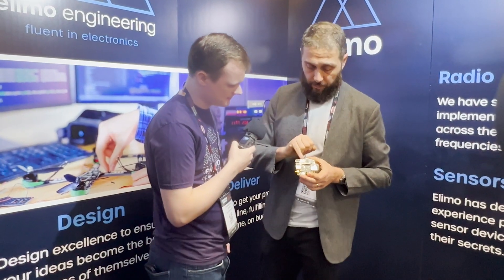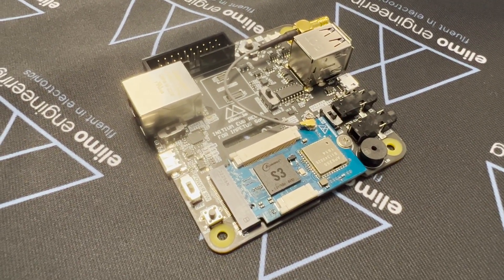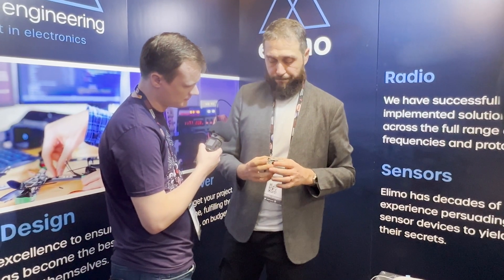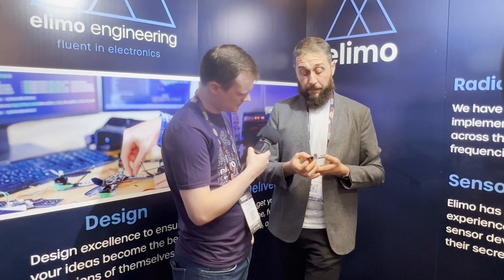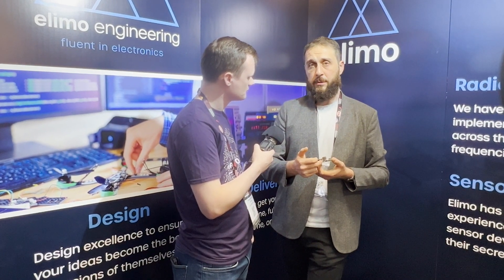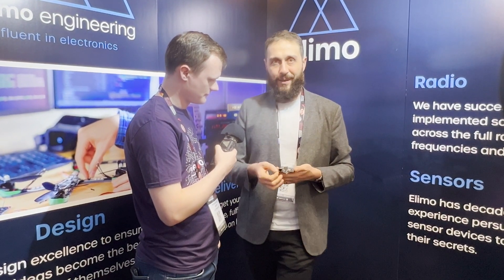This component here is a combo chip with Wi-Fi, Bluetooth Classic EDR, and Bluetooth LE. It comes with an external connector for an antenna — you could probably get a few meters of range without the antenna, but don't do that. It's good enough for testing. You can power it either from the debug connector or from USB. On the USB-C port used for power, behind it you have an FTDI, so with just one cable you can get power and access to the Linux console.